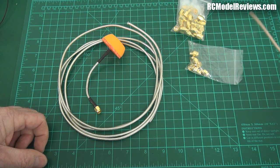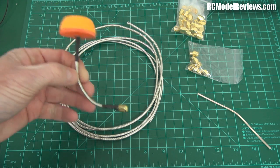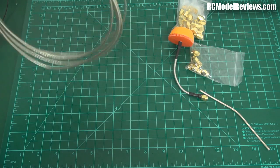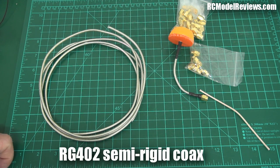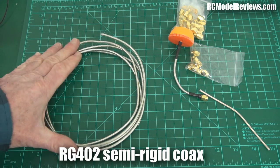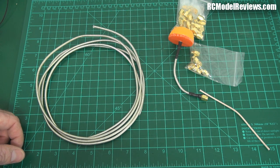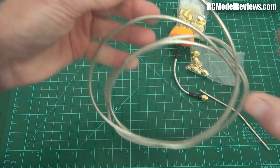So what do you do if you want one of those cool antennas that just stays bent when you bend it? Obviously you've got to use a different sort of coaxial cable. The cable I'm using comes in a little hank, and you can buy this on eBay — it's really cheap, about a dollar or two a foot. It's a great cable for making circularly polarized FPV antennas.